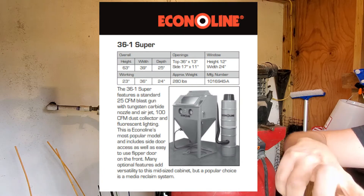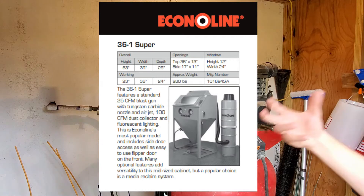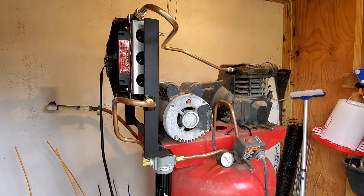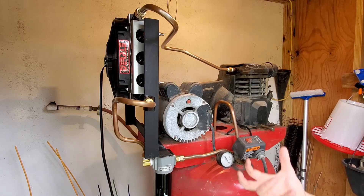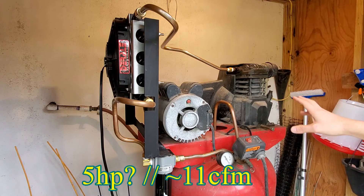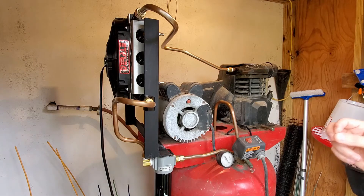The media does not come through the nozzle like you would want it to. If you buy a sandblaster or something that requires a large volume of air, you will quickly realize that the more air you compress, the more water you're going to have to deal with in your lines. This is a 60-gallon, I think five horsepower compressor. For things like airing tires or using air tools a little bit, you don't really run into this problem as much — you can put a drain on the bottom and let it run once or twice. For those cases, water is a nuisance but not a problem.